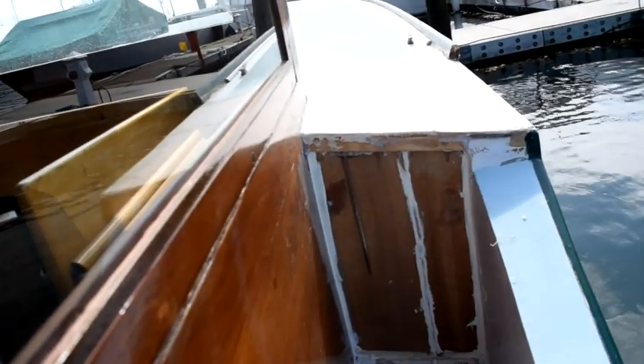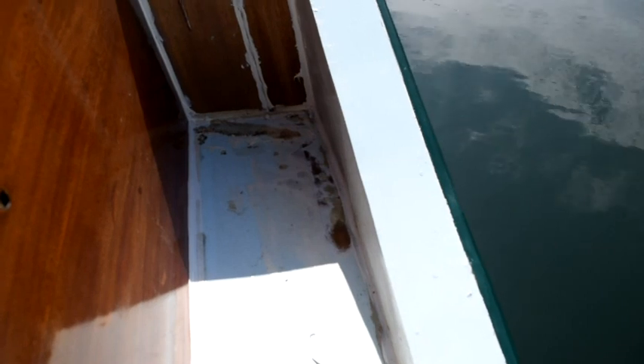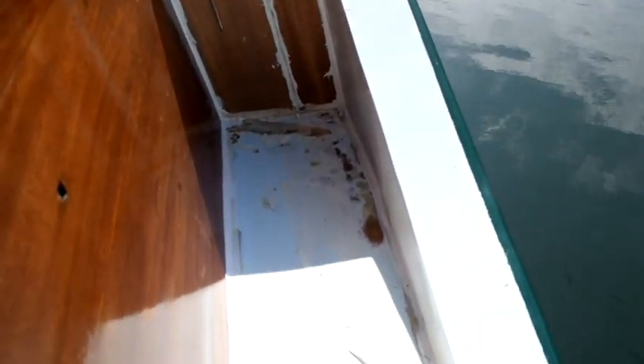I've got to sand this area out but it's very difficult to work in there, so I'll probably wait until fall to clean all this up and do my painting. With one more dab of caulk right up in the bottom of the corner, that should do the job. That should be sealed up now. I also caulked a little gap up here between the outer trim and the side of the deck where it slopes up — that probably wasn't leaking into the boat since that's a joint between the top of the planking and just a piece of trim. But I just put a little 4200 in there to close that up so there's no possibility of leaking. So all the leaks in here should now be plugged up.